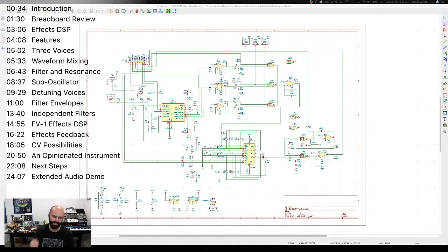So the harder you hit the key, the harder you get that initial hit on the note. But I also want to make sure that you could basically map a CC number, like a fader on a controller, or an automation lane in Ableton or in your MPC Live or anything. Basically, the point is anything that can be controlled by a voltage within the unit or via a plugged-in semi-modular control voltage that's being supplied can also be manipulated via MIDI. So that's the goal here.